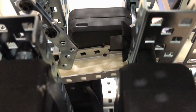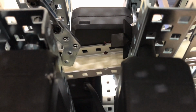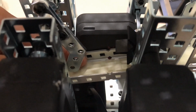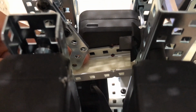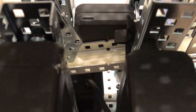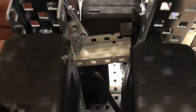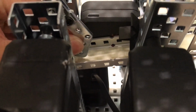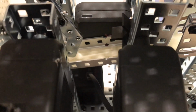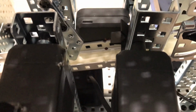Up here at the front you can't really see it, but I've got a vision sensor that has a camera looking straight through this little square right here. So it's taking in all the light intensity and how that's working, which is why I have the flashlight. And then this, of course, is that arm that's allowing the marbles to stay in the position it needs for the vision sensor to take into account those color signatures.